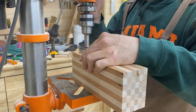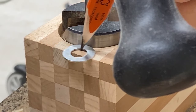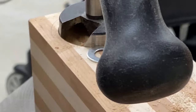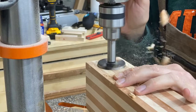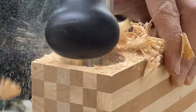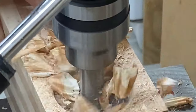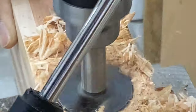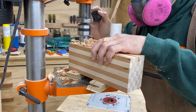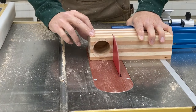I am using a 2 inch Forstner bit to make the hole where the pencils are going to be placed in. I'm making a reference circle around the hole that I'm drilling — this is going to be used later on as a reference for when I'm bringing it to the sander, trying to get a perfect curve in the front of this thing. By the way, when you're using bits this big you want to slow down your machine significantly, otherwise you're going to burn out the bit and it's not going to cut right.